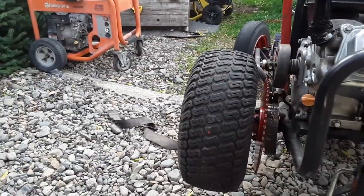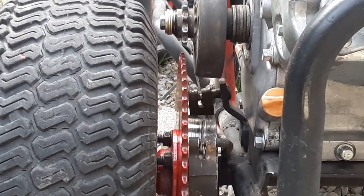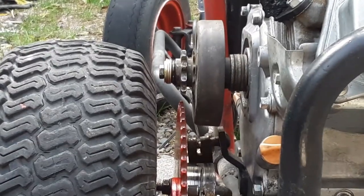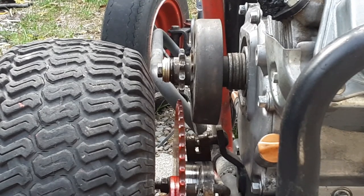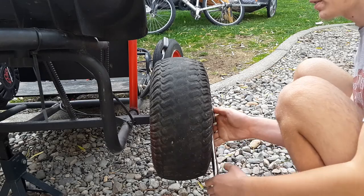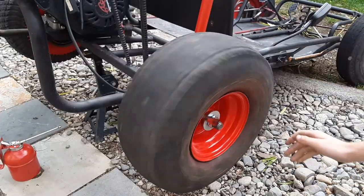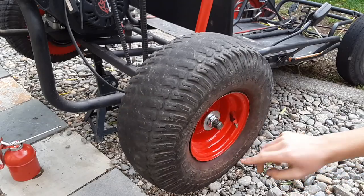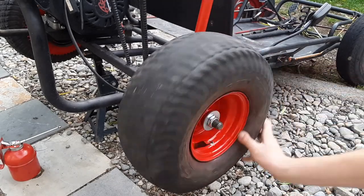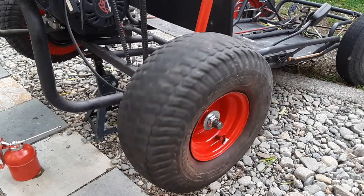You want to make sure that your sprockets are aligned. You want to make sure the bottom sprocket on the wheel lines up with the sprocket on the engine. If they don't, you're going to have issues with the chain hopping off. When you're tightening them down, you do not want to tighten the bolt down all the way, because if you tighten it way down, the wheel does not freely spin as well. In some cases it can cause your wheel to completely lock up. You don't want that — you want your wheel to spin freely, like this.